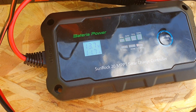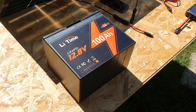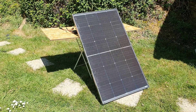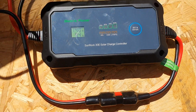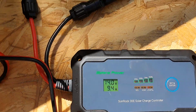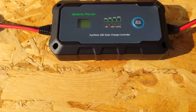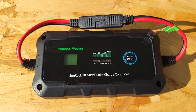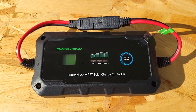I should mention that if you're using a 24-volt battery paired with a 30-volt panel, for example, the conversion losses would be much more minimal and a PWM could be quite effective in that scenario. But honestly, that would be the real best-case scenario for a PWM charge controller. For most people who want the most efficient system and the most flexibility, definitely go for the MPPT charge controller.